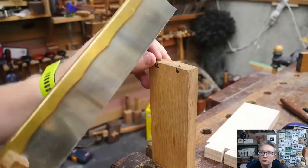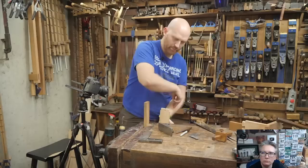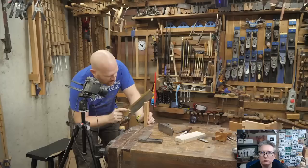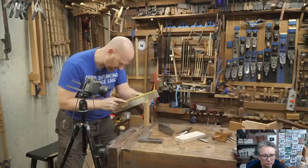I'm going very, very slowly and very, very lightly, taking all the pressure off the saw. I've cut from that corner to that corner — do the same thing on this one, and the next one, and the one after that. If you didn't have a vise, you could put the board on the bench or table and put a clamp all the way across and use that. A vise is better, but not by much — it's just faster. The most important thing is how sturdy is your bench or table that you're clamping to.